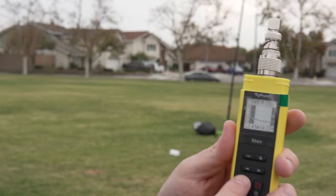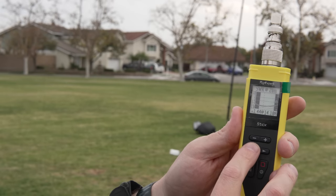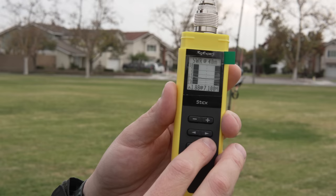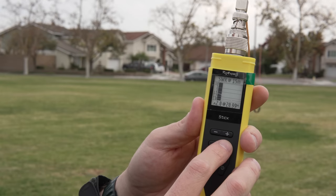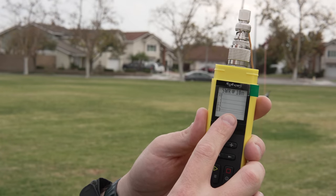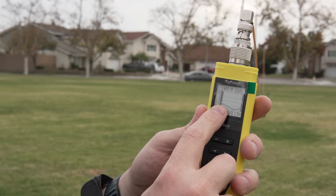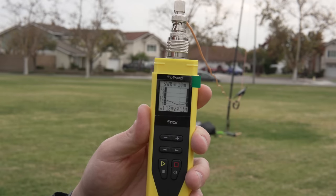Last shot — oh yeah! That's exactly where we want it. Let's see where we're at. Yep — that'll do. I think we did it, guys! I think we're all set. Let's try 15 — a little short for 15, but not bad. And there's your 10 meters — we're still under about 1.2-to-1 for the technician portion, which is where I want to be for single sideband. So that's it — awesome!